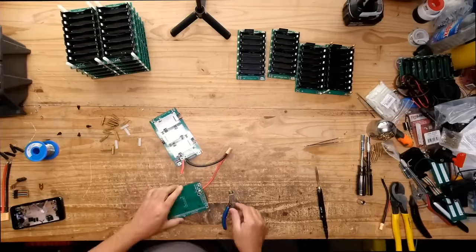Terrible. Anyways, what I was saying is that at this point, I figured out that two of these boards were dead. And somehow I blew those fuses. Change that fuse. Now let's check and test to see if we have power. Oh, 29 volts, right? So that's what it was. Here's the thing. I might have blown those fuses when I connected the ribbon on those two sides. Remember, I put that load, right? I had the thing, and I put the ribbon on those two sides.